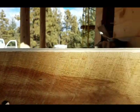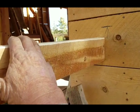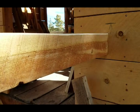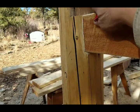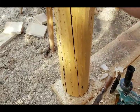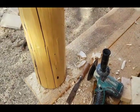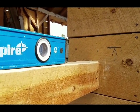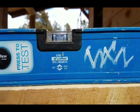I carried a mark over - it's level - and that's the top of the finished handrail. What I have to do now is bring this down to level, which is whatever the thickness of the handrail - in this case it's one and seven eighths. I'll come down one and seven eighths and then I'm going to work on plumbing this board with the deck so that it's in and out proper. I plumbed a mark down from right here down on my deck. The deck is perfectly square so this is plumbed. I'll carry this mark over to the other end, plumb up again and that'll be the anchor point for the skirt piece. I've got the other side of the skirt which anchors into the cabin plumbed perfectly and set level, so I can mark it and anchor it right here.